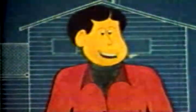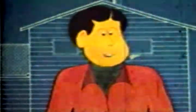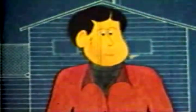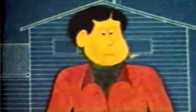When drawing very large objects, such as a building, in an isometric or oblique projection, the perspective view is used to show distance. As we can see here, the ruler is much narrower at the far end. This is known as a perspective view. Notice here how the object's length seems to change as the vanish point is changed. This shows the location of the vanish point is very important.